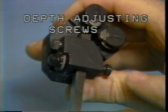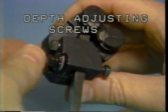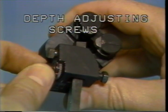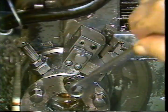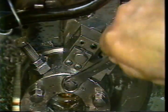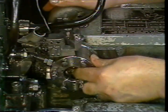These two screws will be adjusted in the machine to control the depth of cut of the box tool. They are adjusted by loosening one screw and tightening the other. The first step in setting up the box tool holder is to mount it in the proper position in the turret. Snug down the clamp bolt at this time. Release the turret locking latch and rotate the turret to be sure the box tool does not contact the machine or any other tools.